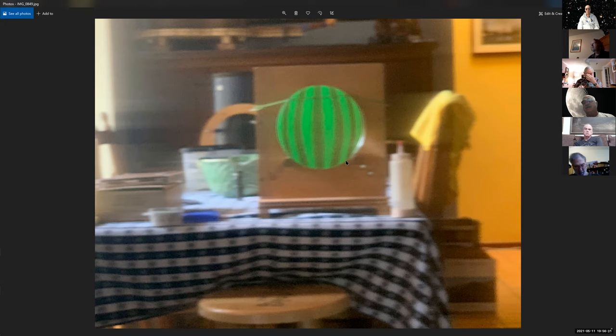In this view here, which is inside R, your inside focus, you're going to see this kind of watermelon look. So the lines are bowed out, and that's the kind of look that you're going to see. Usually what you end up analyzing inside R is more the center of the mirror. You really get an idea of what's going on in there, not so much on the outside. On the outside, the lines are going to bow the other direction, and that's when you're really testing the edge more.